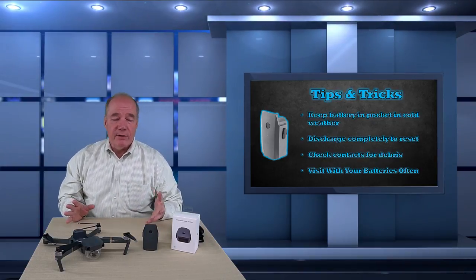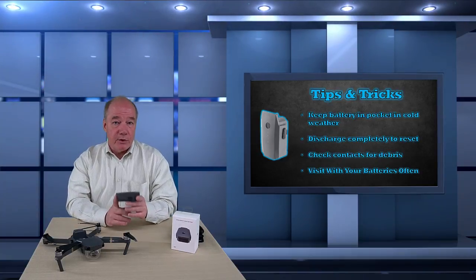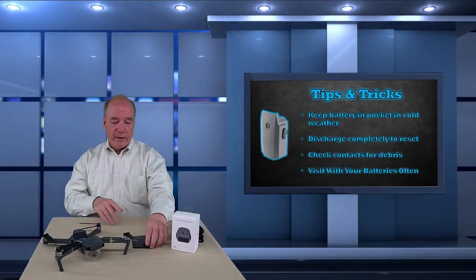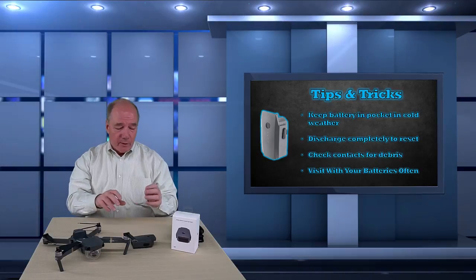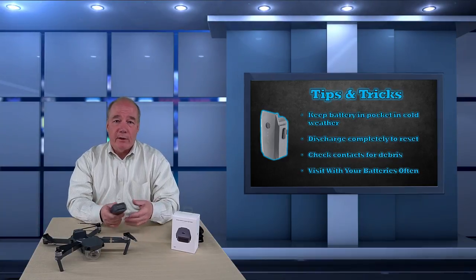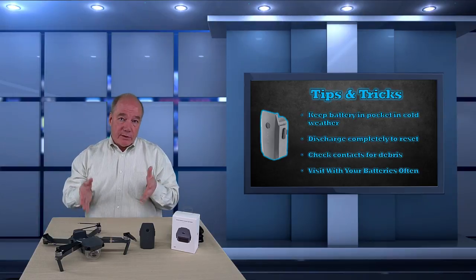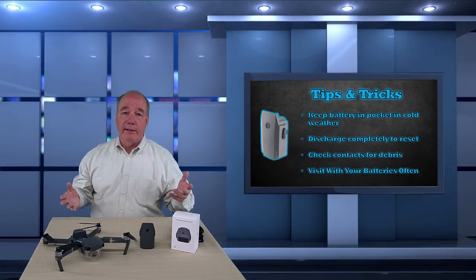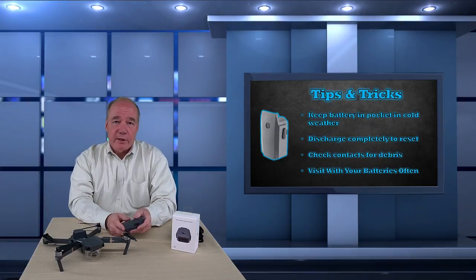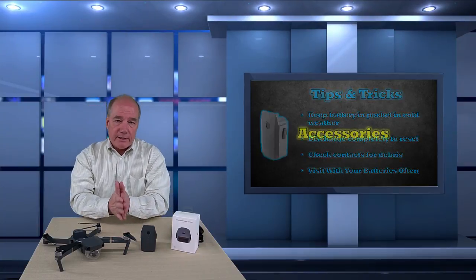Visit your cells often. I have friends who get excited about flying, then get busy, put the quad in a case, and forget about it. If batteries fully discharge because they've been sitting too long — past that 8-10% residual — those internal cells get to true zero and I don't know of any reliable way to recover them. Put a calendar note in your phone to check your cells every three to six months: open the case, charge them, discharge them, fly your quad. The worst outcome is opening the case expecting to fly and finding none of the cells recover — that's $400 in batteries gone.